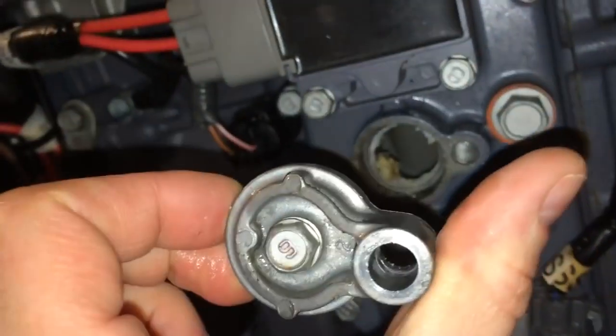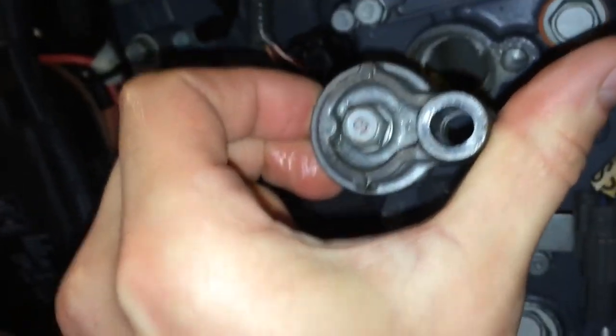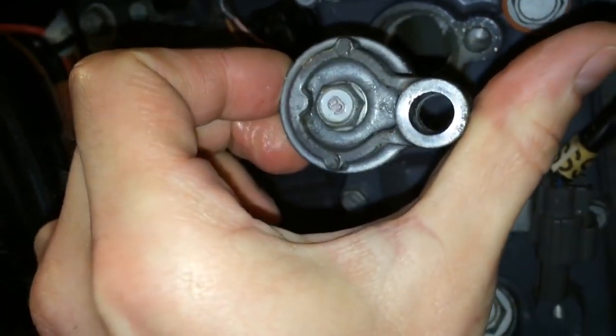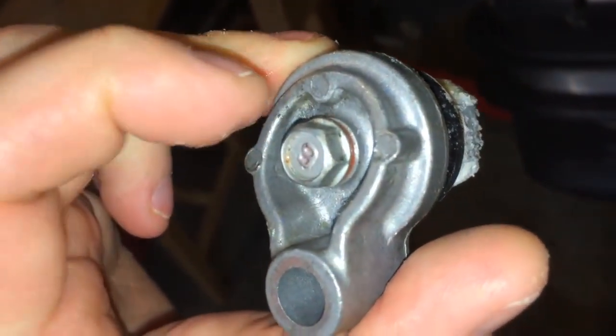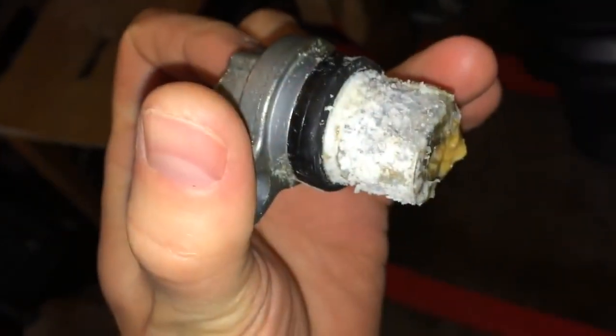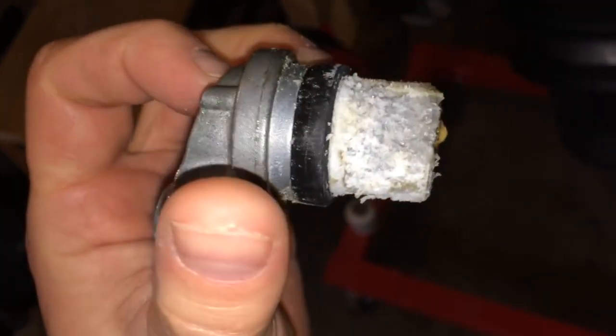You can see here it's held on like this — it's held on by a bolt on the right, 12 millimeter, and then the actual zinc is held onto this plate by a 10 millimeter bolt. So you'll want to remove that. The actual replaceable part is the nasty crusty part. Save the o-ring.